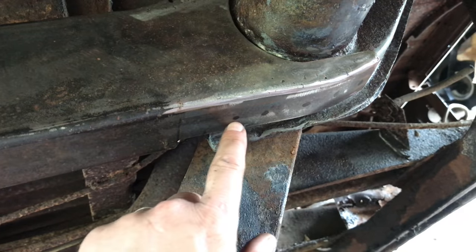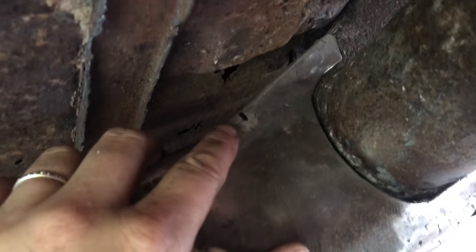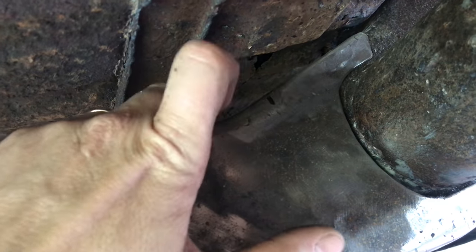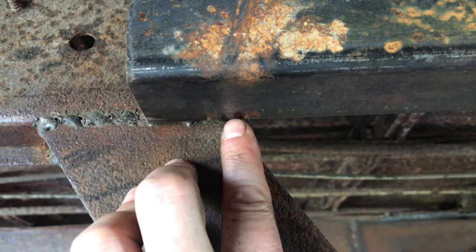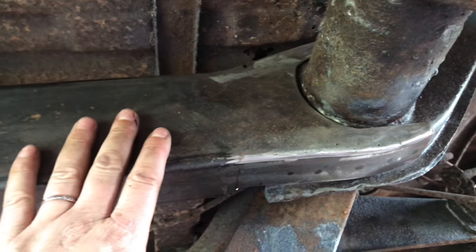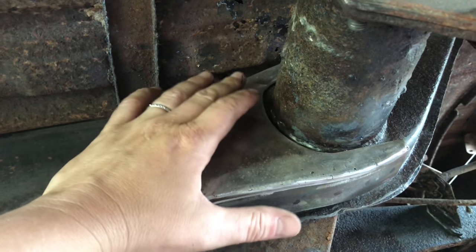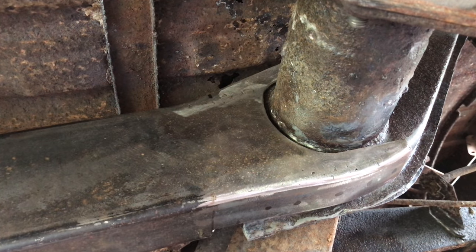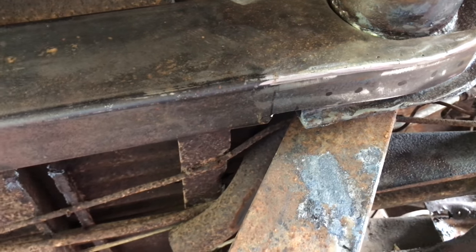I've marked my spots - I put five and I'll go in and evenly space them. I'll make a mark where this ends and we'll just try to get those kind of about an inch apart. I can't take a sharpie while it's in there and mark where I need to go, but we'll just evenly space probably two or three little plug welds up on top there. I've made a mark here where to cut. So I'll take that into the saw, drill some holes and cut that end off and see if we can't hammer that in there. I think once we've cut that end off some of this gap that's here will be closed. I notched right there - probably shouldn't have done that. Live and learn. Let's get that drilled out and cut.